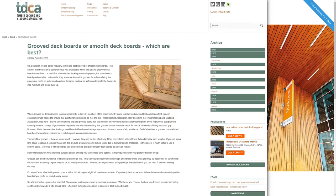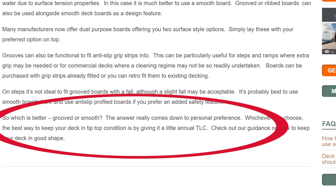I've got some useful background from the Timber, Decking and Cladding Association website. Decking has obviously been a big thing in countries like the US and Australia long before we caught on over here, and they all advocate using the grooves face down to allow for airflow underneath the boards. When demand grew in the UK, grooves facing upwards apparently came about because of a collaboration between a manufacturer and a high-profile designer, thinking grooves would be better for the UK climate and offer more grip. With manufacturers now offering dual-purpose boards, the TDCA conclude it's up to you to decide which style you prefer.